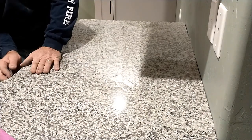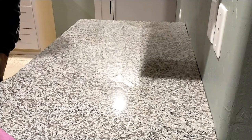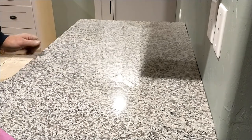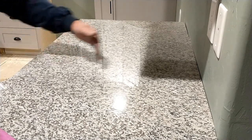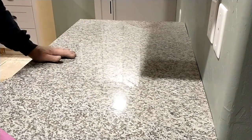Don't forget the front of your top. A little more on these countertops. I found a material man in our area, in a major city, that sold these, and they're known as prefab countertops. They have a finished edge on two edges, one long edge and one end, and they're cut to 26 inches in width. So they fit on standard cabinetry real nice. All you have to do is just cut your miter seams.